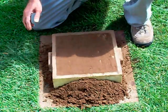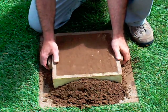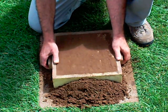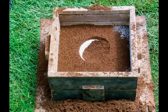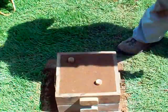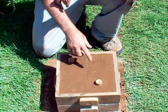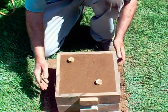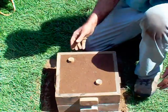With this done right, the pattern will stay in the sand. We've got to lift it up carefully. If I did this right, the pattern inside should stick to one half the box or the other — the mold. We've got to lift this up pretty straight so you don't crack up the sand and have it drop out.